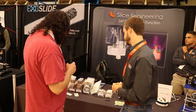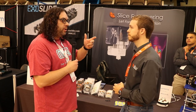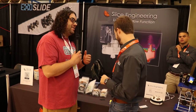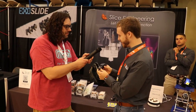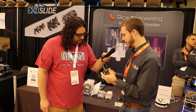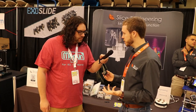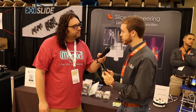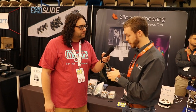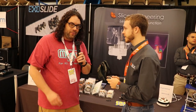That's really cool — I can basically have two different hotends between those two and just swap a couple parts out. We have some really cool stuff on the table. Anything coming up we should know about? What we've got here is a silicone boot. It's a platinum-cured silicone — we're calling it a boot because it's a little sturdier than what other people are making. This is in pre-production; we just finished beta testing. We'll be launching these pretty soon for people that want to improve bridging performance. If you've got a lot of part cooling air flowing and you don't want to cool the hot block, this gives you that instant bridging performance. I can't wait to test that.